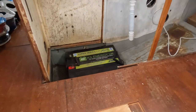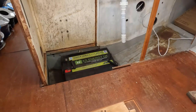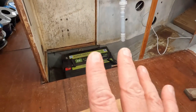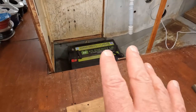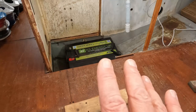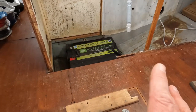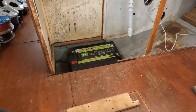I think the American ABYC standard allows for an inch of movement, which just seems crazy. I want to make it so these batteries cannot move, but also make it so that if we ever change batteries we haven't got to rebuild the whole compartment. So it will be slightly larger than the batteries with braces across for these specific batteries.